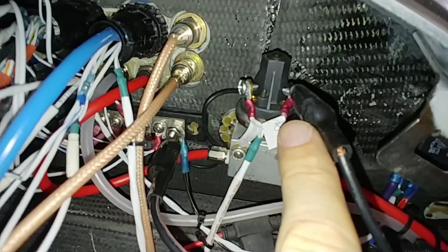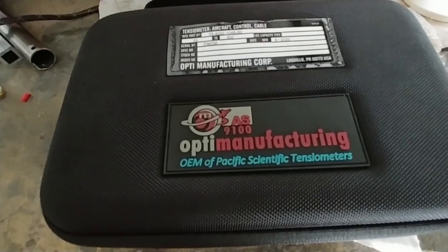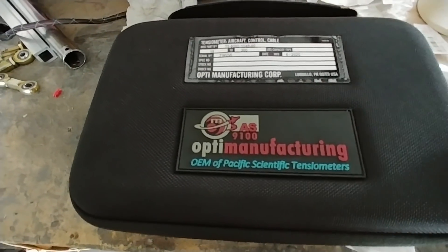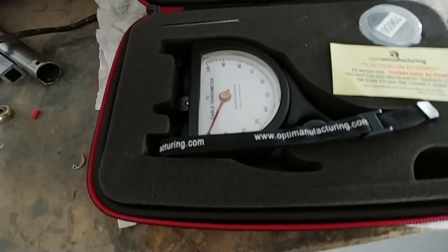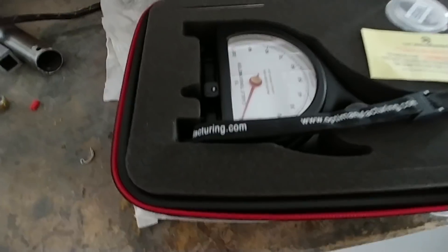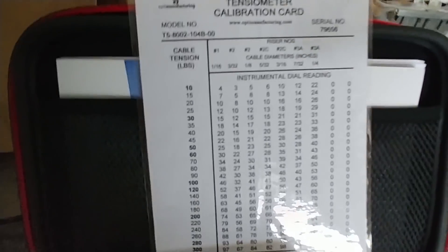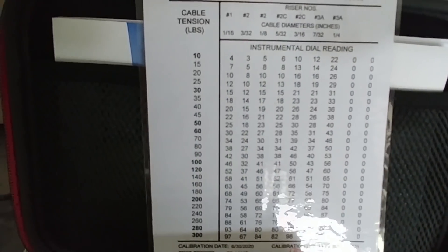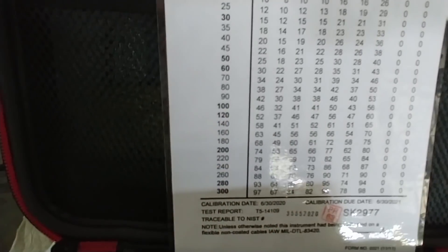I've just got my little wire clips there, taping the ground and passing it across so when I want to cycle the gear up I can. This is my new cable tension gauge that I bought — I needed one that would go up to a higher tension setting. This one goes up to 300 pounds on 1/8-inch cable. It comes with a scale that goes zero to 100 and a calibration table that tells you, for whatever cable thickness you have, what the tension is at a given reading. I'm working with 1/8-inch cable so that's the column I'll be looking at.